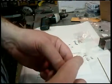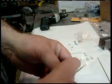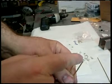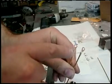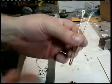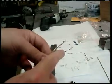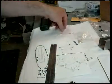So I'm just going to go over and lay these on a brick so I don't burn anything. Hit them with the torch, hit them with a little bit of solder, you know, because here's the crack in the seam in the eyelets. I'll make sure that I flow some solder around that and around the brass, so I know they're all good and solid. Okay, there they are, all soldered up nice and pretty, as you can see. So there's our 2 walking linkage.